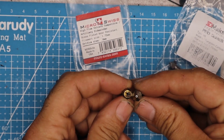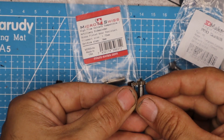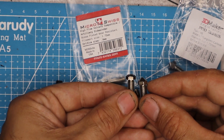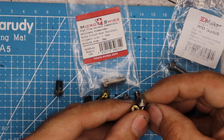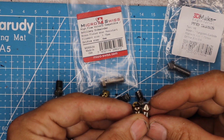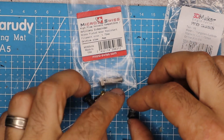This is the used and this is the brand new Micro Swiss, so you can see what 1.5 kilograms — two rolls of GF-30 — did. It's really, really rough; you can see what it did. It destroyed the nozzle, and that's why that print was so unpresentable.